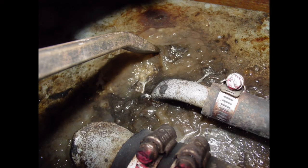Corrosion can also occur if the tank bottom has inadequate bilge clearance and often rests in bilge water. The estimated service life for an aluminum fuel tank in an open cockpit-type boat is around 20 years. So if you're contemplating buying a boat of that type and it has an aluminum fuel tank in it, there's a couple of things you need to do.